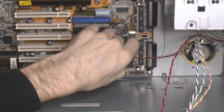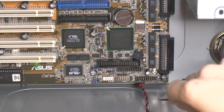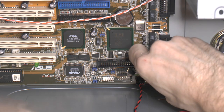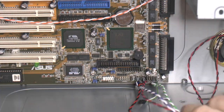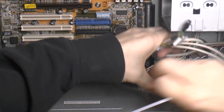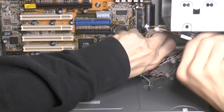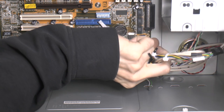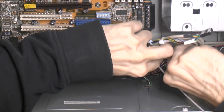So I'm thinking we should just get the front panel headers out of the way. Don't really need a speaker cable since we have a speaker in the motherboard, but I'd rather connect it to not have cable dangling if I can avoid it. I'm tucking away the audio connector because the motherboard doesn't have any audio and my sound card doesn't have any header, because it's Creative and some of the early ones don't have the connector at all. You could buy adapters for later ones, but the one I picked has nothing. The Sound Blaster Live seems to have nothing for that. You can obviously mod them like people have done. You can just solder the wires to the rear ports to get the front ones that way. But I'm not gonna bother. I rarely use the front ones anyway.